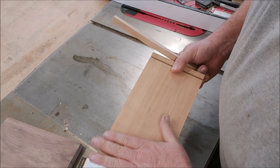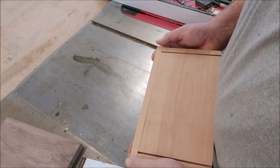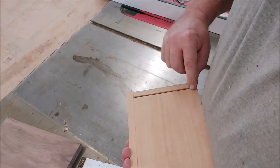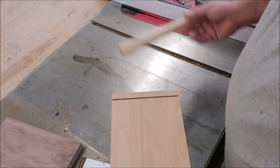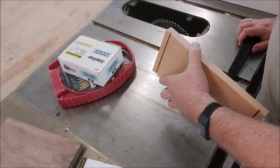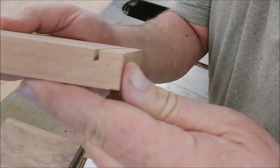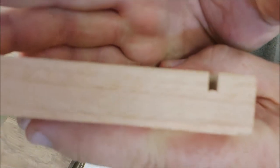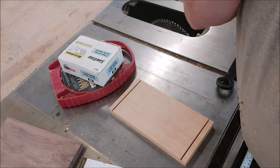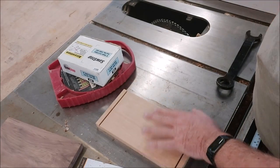From this you might start to see what I'm doing. There's a lot of material to remove, however — dado blade, I think. That's going to give me a place to run my side panels up against this edge and this edge. If that still didn't make sense, just stick with me — it will in a bit. This alternating top bevel blade is not really the right thing for this; however, with the combination of the dado blade to clean it up it'll work. The bottom of that groove I made — it's not flat.